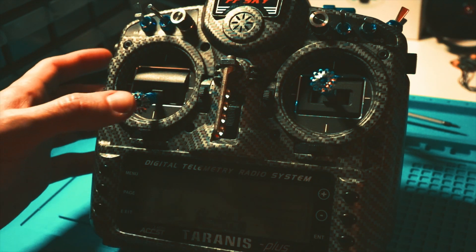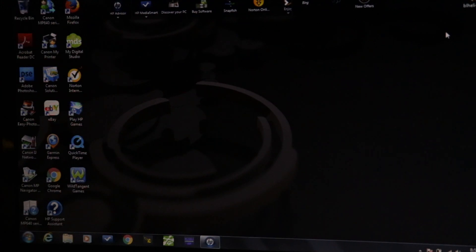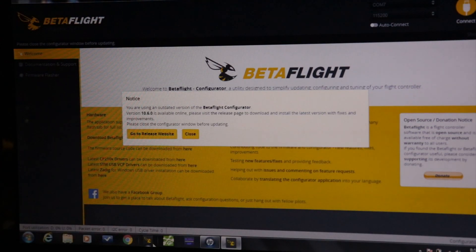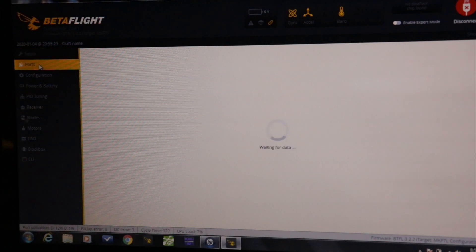With that we're going to go back to Betaflight and start setting that up. Now we're at the computer — open up Betaflight. I highly recommend taking off the propellers while you're plugging in the drone. Once you connect, go to Ports. I'm going to enable UART 5 because I set that as RX 5 and TX 5 — you may have set it up on a different UART. Then save and reboot.